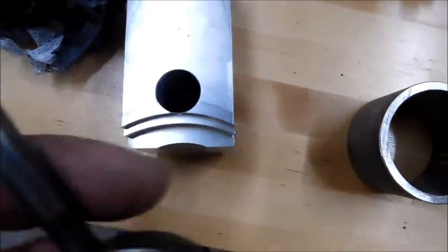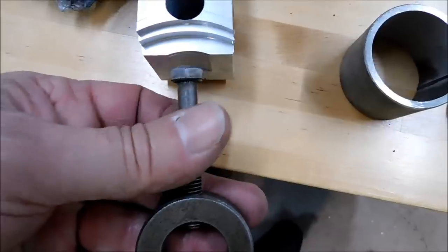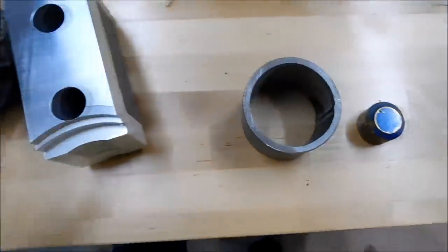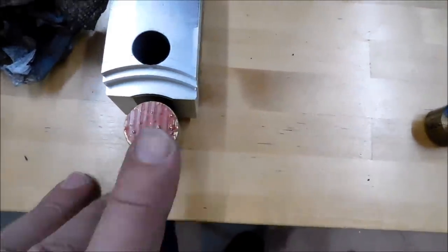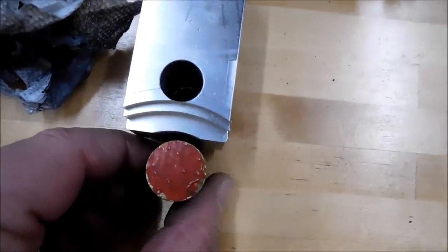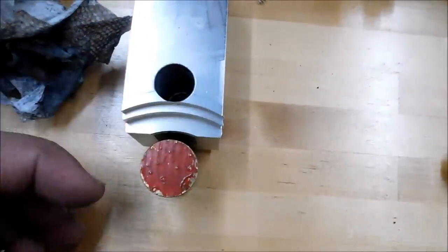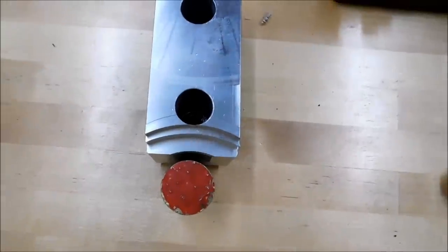Now, if you're going to do this, here's a really good idea. If you do not have an adjustable spider, where once you've bored it, you can say, oh, I don't like the way it felt, so crank these in, squeeze again, rebore it. If you're going to use a solid plug, brass pipe, it doesn't matter. If you have a plug in between the three jaws that you're boring, instead of having to take this out and turn it down, leave a shim in here. Put a piece of cardboard or something else on one or more of the jaws. That way, if you overbore the jaw, you can open them up, take the shim out, close back down on the same plug, and you've just bought yourself some more material to bore out. Just don't re-bore it to the same setting that you had on the dials before.